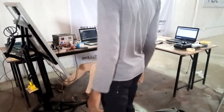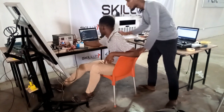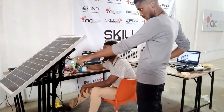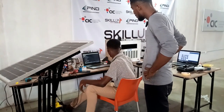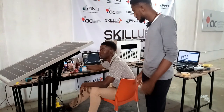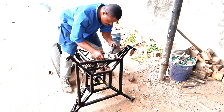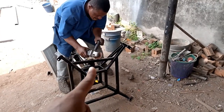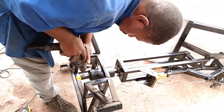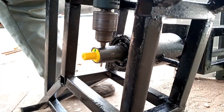Uploading the code, we encountered a slight problem: the panel reaching its lowest point couldn't go any further, since there was no sensor as feedback for its position. The panel kept hitting the wall as it tried to keep moving down. We made a slight adjustment to the code to have the panel turn upwards. To return the panel down to the opposite side, we uploaded another code and the system began turning down. With this settled, we started working to install the stepper motor for the horizontal axis. Mr. Kingsley cut out some parts to enable installation of the base for the second motor.